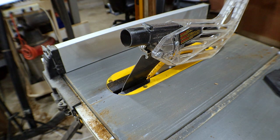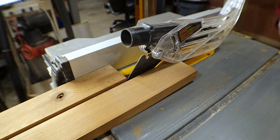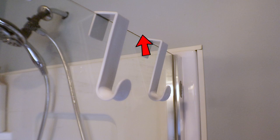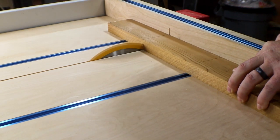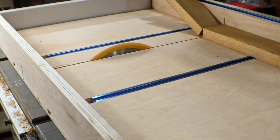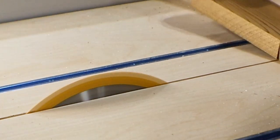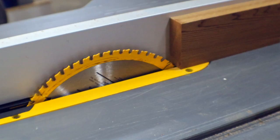Now I'm going to rip the board into two equal halves. Rather than make a long hanger that spans the entire length of the shower glass, I decided to go with shorter lengths so we can use one or two per side depending on our needs. So with that in mind, I can take my two equal boards over to the crosscut sled and cut them to width. I need these to have a channel in them that will sit on top of the glass. The glass is about a quarter inch thick, so I'll make my channels just a little wider than that.